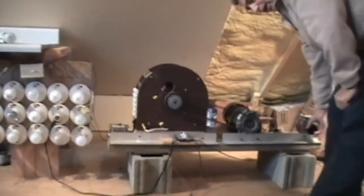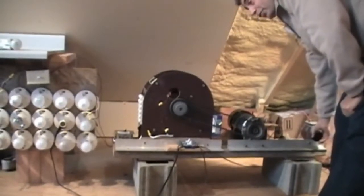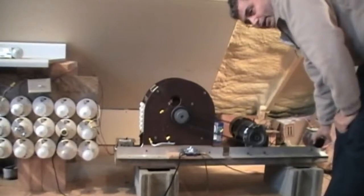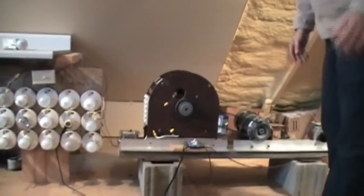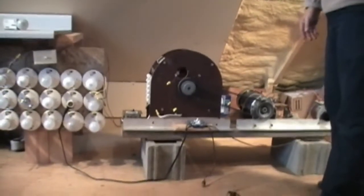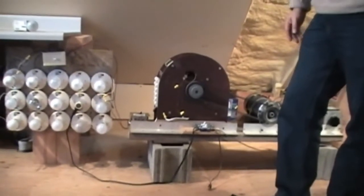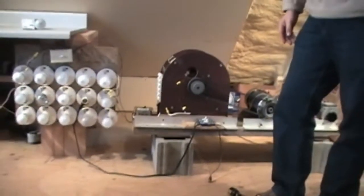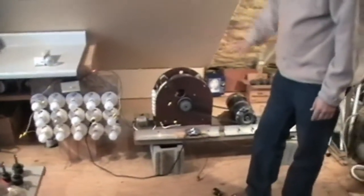Since it's running a little faster, the power must be a little bit different, but we keep it pretty close. When I looked at it on the scope, it was exactly the same as what's coming out of the wall — 60 cycles. What happens is the power input changes depending on the time of day; the power comes from the power company and it changes in voltage, actually goes up and down. Some days it'll be 115, other days it'll be around 124 around here. That's why it's a little different just now.